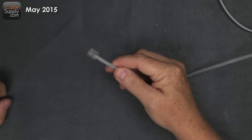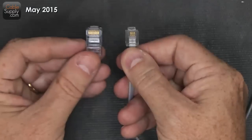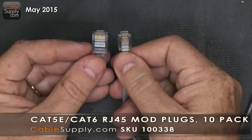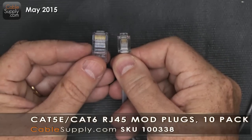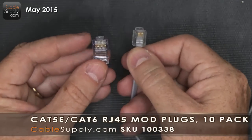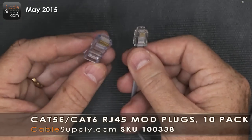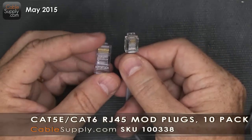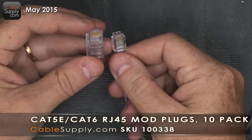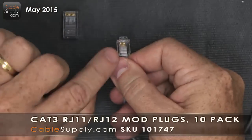The silver satin is a lot easier to work with and the flat cable is a lot easier to crimp. But let me show you the difference with an RJ45. This is an RJ45 on the left, and this is an RJ11. It's actually how it's pinned out — how the pins go in — that determines what type of RJ it is. So the RJ45 is used for computers and really old AT&T telephones. You can see there is a difference in these two. There's more conductors — more of those gold things — in the RJ45 than there are in the RJ11.